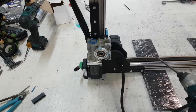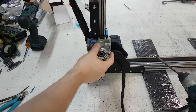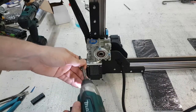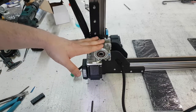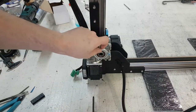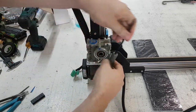The first step: we're going to unplug all the motor connections, and then we're going to start unscrewing these screws — usually two or three screws depending on your model printer. If you are using power tools, please be gentle. Using extremely strong drills can strip threads, so make sure you don't apply too much force. I would recommend starting with an Allen key first, and then you can use power tools the rest of the way.